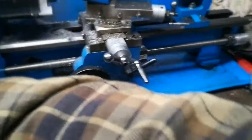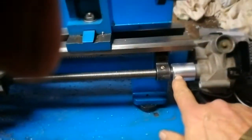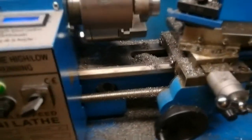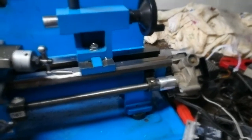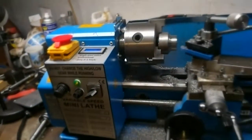If I want to use the gears for cutting threads, all I have to do is loosen that set screw, pull that away, and put the main drive gear in — then I can use the lead screw the way it was intended. I only put this motor drive on here because I wanted the option of going slower without having to change gears. Also, now I can leave the lead screw drive gears disengaged, which puts a lot less stress on the motor — that's one less thing the motor has to turn.